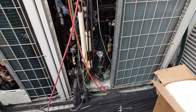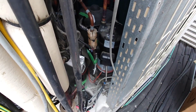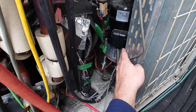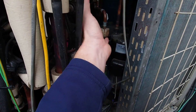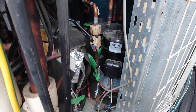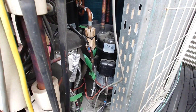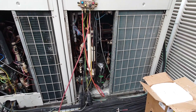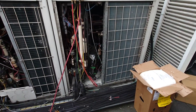Looking at the condenser — that's the compressor we're changing in there. We've measured it up and it's going to be a bit of a pig to get out, but this gap here between the coil side and compressor number two — when you push these pipes out of the way, unbraze them and get them out of the way, it should slide out of this gap without too many problems. There is a carrying hook on the top of the condenser should you need one to lift it. When you first look at it you might think you've got to get the coil out of the way, but you can't — this coil is a wraparound coil, don't waste your time. It does come out of that gap.